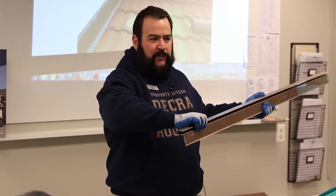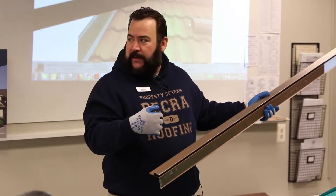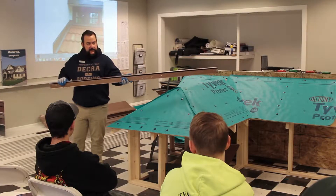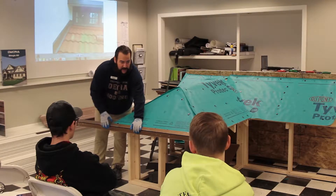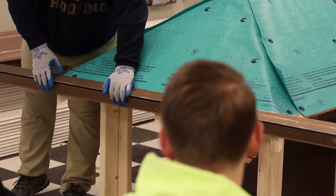My thought process was bulletproof — you put it on there, no way snow and ice is ever going to back up through your gutters. And it does all that. The problem is, it's also a very rigid piece. It's not like an aluminum drip edge where you can kind of suck it in where you need to and make it fit. So when you get into these older homes where your eave lines are snaked, it's a problem.